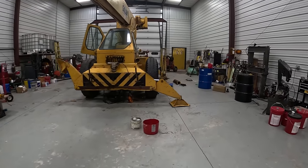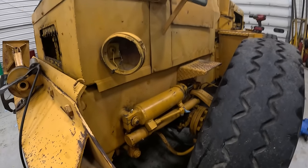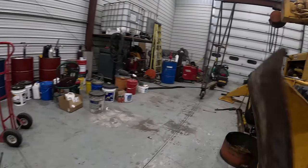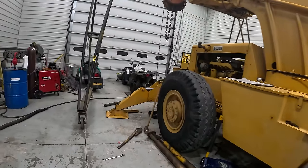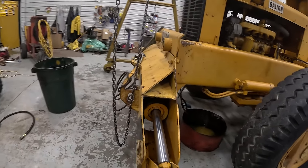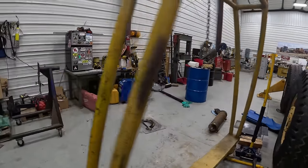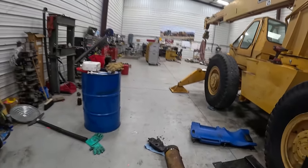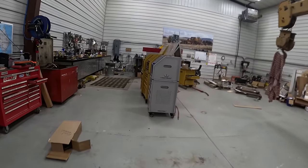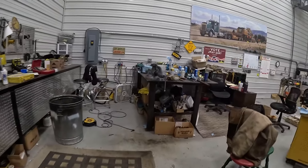Alrighty, so I got this other cylinder, steering cylinder, put together and installed. That was a good cylinder inside, honed it, cleaned it right up, went together, piece of cake. Got my outrigger on back here. Got that one all installed, she's good to go. So I'm gonna start cleaning up and going through the check valves for those outrigger cylinders and get all those cleaned up, put back on, and then get some hoses made for them.